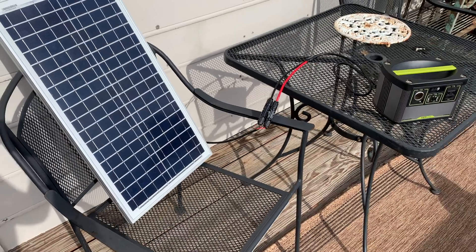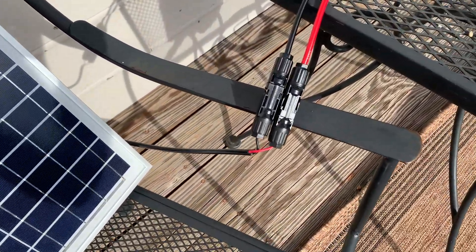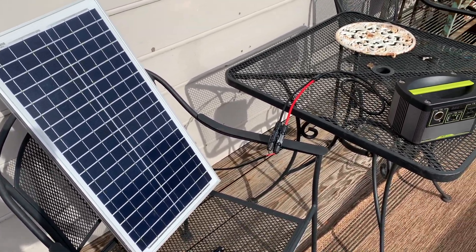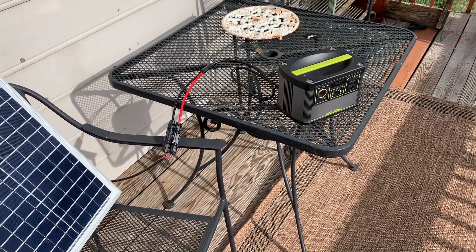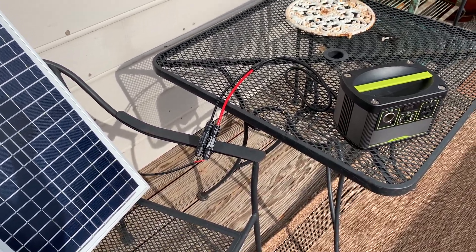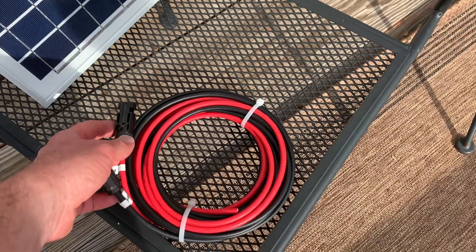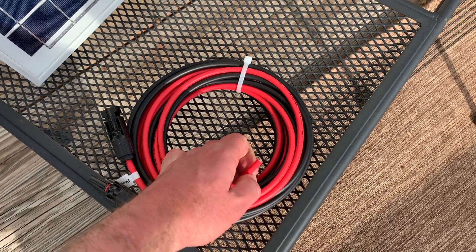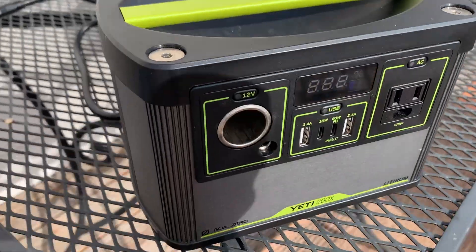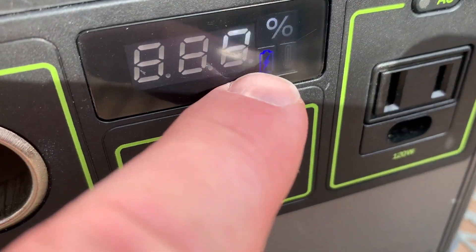We're back out on my back deck. Here's our solar panel — it's afternoon sun so I'm angling it towards the brightest spot. We have the cable out to the MC4 connectors and that into our little adapter that goes straight into the 8 millimeter input. One thing you'll notice with this setup is it doesn't have very much cable length. I don't like leaving the Goal Zero directly out in the sun, especially on really hot days — if you've got an RV or camper van you want to keep it in the shade. So one thing we highly suggest is this extension cable. It's got MC4 connectors on one end and the other ends are open but it comes with an MC4 connector you can clamp on.